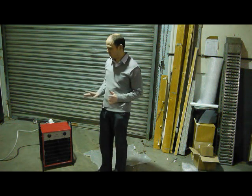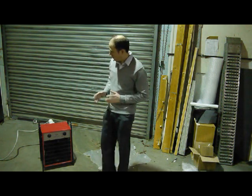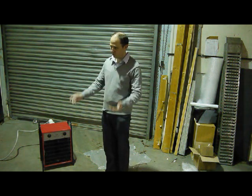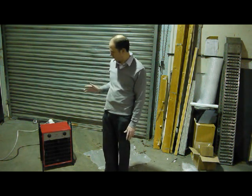These are great for places where you can't have a naked flame but need a lot of heat. The most you'll get from a standard 3kW wall socket is 13 amps, 3kW of heat. A 32 amp socket gives you up to 22kW.